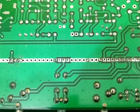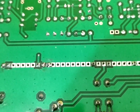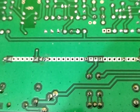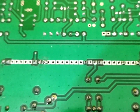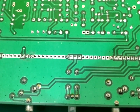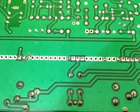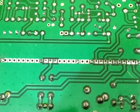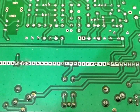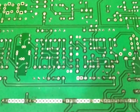When you mount the connector strip, you don't need to solder all the pins — it's not required. Just solder the ones that are required, otherwise it may create a mess if your soldering is not up to the mark. Make sure you don't miss the required connections — check that you are getting ground and all necessary connections are properly soldered.